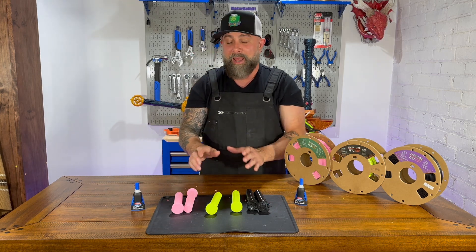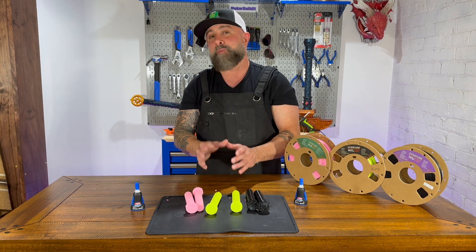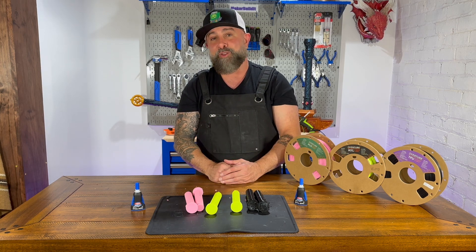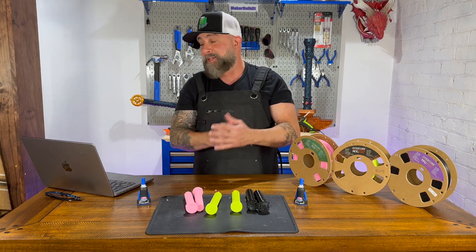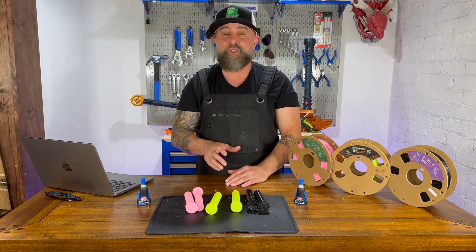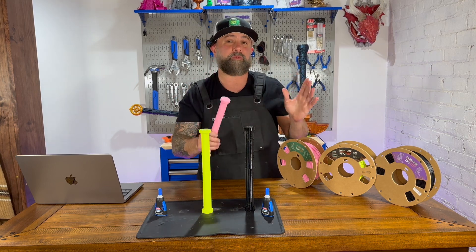I'm not really sure what happened with the PLA or the PETG. It is super humid here — it's been raining quite a bit, so I'm not sure, but we did give this ample time to dry. Maybe I'll try bonding the other side and do another test. I did some quick research and asked ChatGPT if humidity plays an effect on super glue, and it does — moderate humidity for super glue would be between about 40 and 60%. It's been raining all day, so I think that's what caused our issue. We let the dehumidifier run overnight and it seems like our super glue has bonded, so we're going to perform our test.